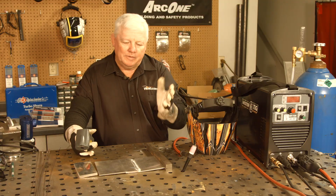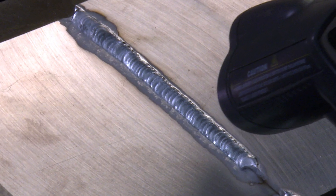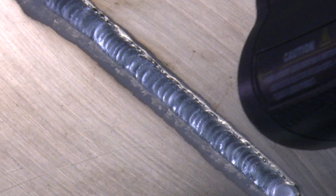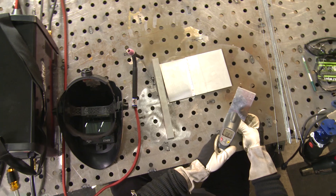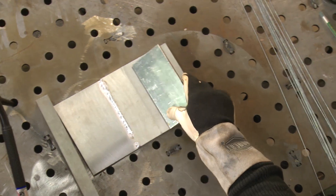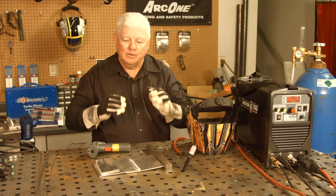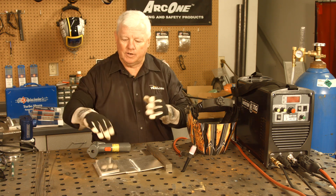I welded this up. The melting temperature of aluminum is arguably between 1200 and 1300 degrees Fahrenheit. I used this little machine that runs off 115 — did a fine job. Now I'm getting ready to put this heavy-duty piece on here. I check it and it's 81 to 82 degrees. By setting this thing on here and merely preheating it up to about 125 degrees, it really helps the duty cycle of the machine — I don't care which machine it is. Just taking the chill off that aluminum makes a big difference.